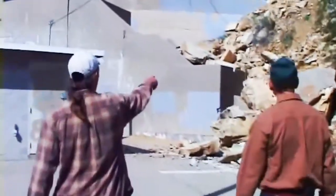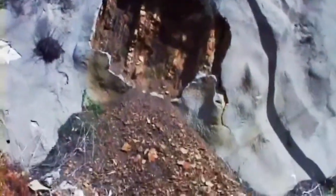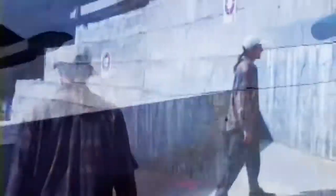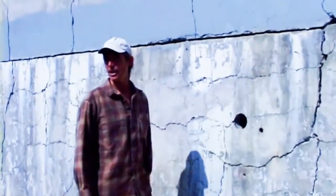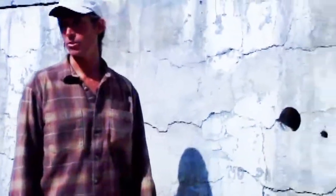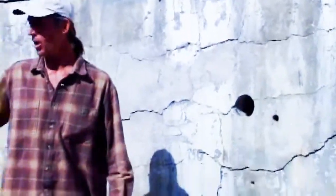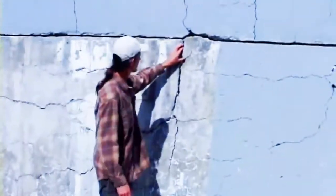We're here at the Matilija Dam with Paul Jenkin, founder of the Matilija Coalition. The concrete is all broken. This section just came down this year — you can see they sprayed some shotcrete on it trying to hold it in place; worked for a little while. You can really see the cracks in the concrete. They drilled core samples out of the dam in several locations to test the concrete. What they found is that deep inside and down at the bottom where it's compressed it's still fairly sturdy, but it's falling apart at the top — up where it doesn't have that pressure, it's expanding and cracking.